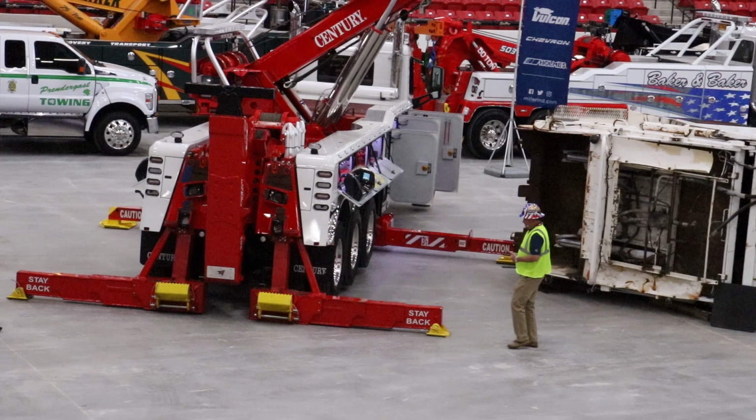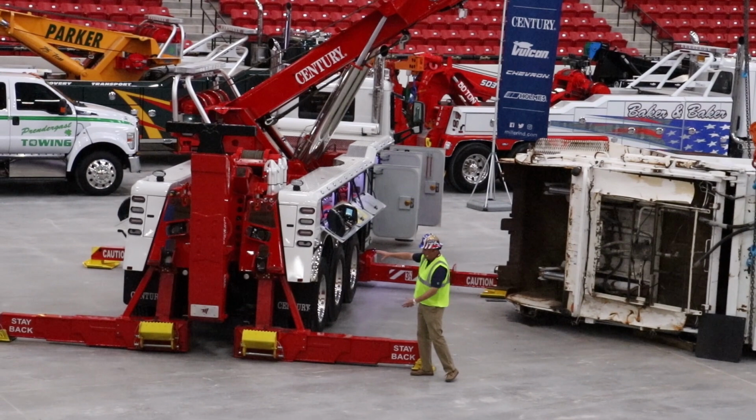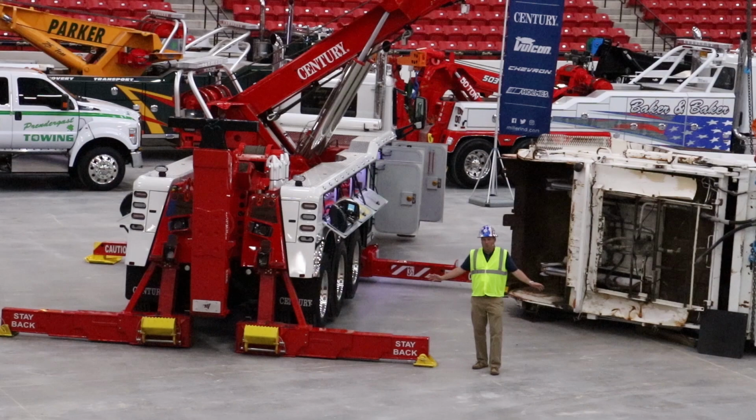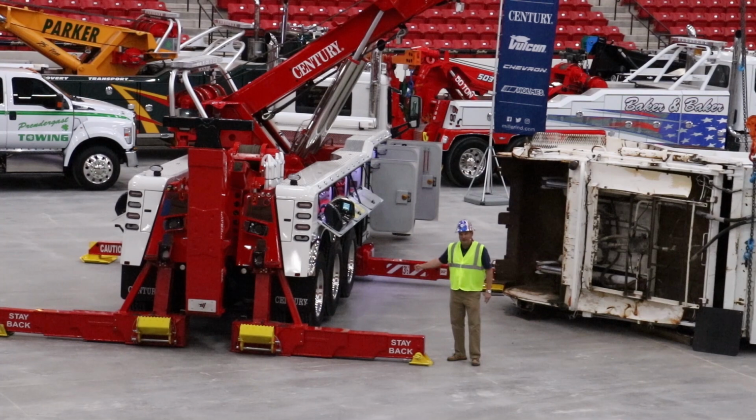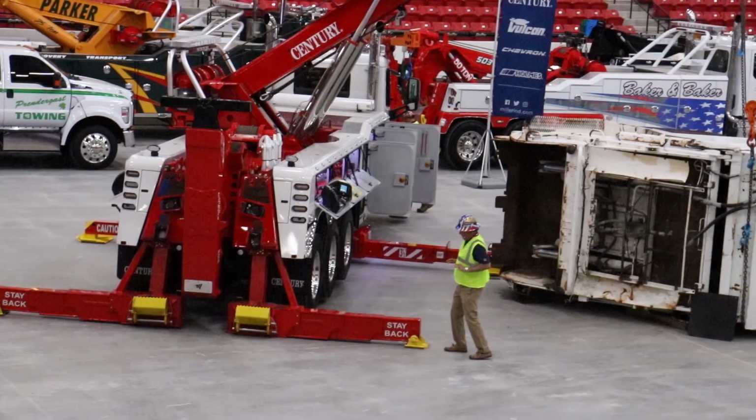As this goes down, it's wanting to pull itself away from that truck. As we go out to the casualty and come back to the tailboard, we haven't neutralized this leg at all. We have this big pry bar out here. It just naturally wants to go whoop, and it will do it. And it'll go whoop, and then we'll break the collar on the backside, and then you're going to call your distributor, then you're going to call your rep, and you say, this thing broke. I said, well, you had your outriggers extended. But that's what happened.